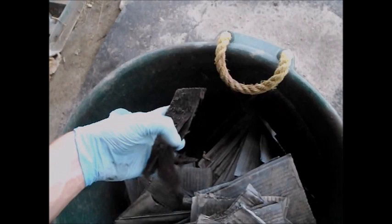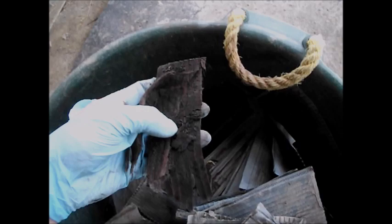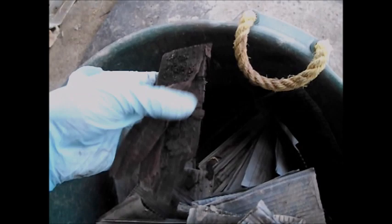Let's see if I can find one that hasn't been torn apart yet. This one has been used and corroded - the positive plate usually crumbles away, and that's what causes batteries to go bad. This is actually the remains of a positive plate that used to be coated in fiberglass. And here you see the red - this is the lead oxide, the oxide that forms at the positive plate. You can see the remains of the lead wire in there, but it's been completely corroded.